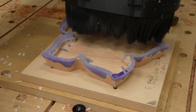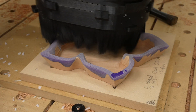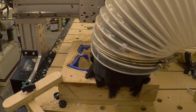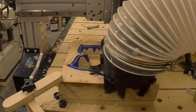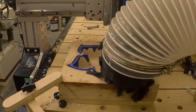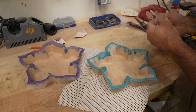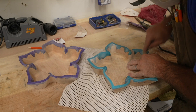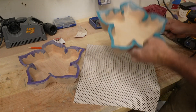When machining the top and inside of the bowl, I use the same feeds and speeds as before. A three-eighths-inch spiral upcut bit removes a lot of the chips from inside the bowl so they don't get stuck in there, which is really helpful. I then use the same quarter-inch ball nose to do the finishing pass. After doing this bowl in both Fusion 360 and Vectric VCarve, I can tell you that the VCarve version is going to require a little bit more sanding — that's just because of the nature of how the toolpaths work in that program. With Fusion, you can really fine-tune a lot of the toolpaths, but this does require a lot more knowledge and skill.